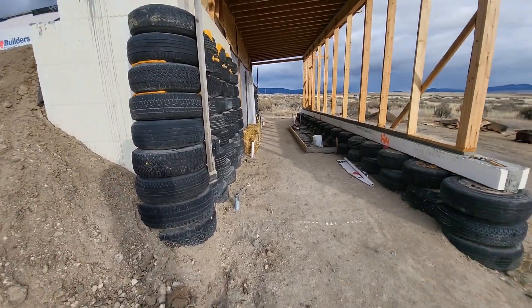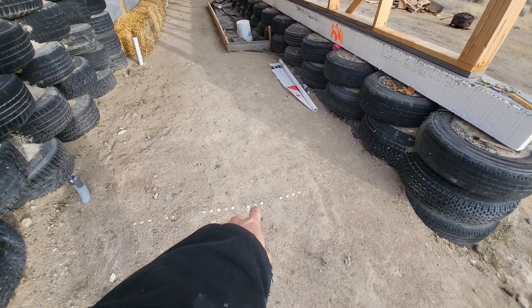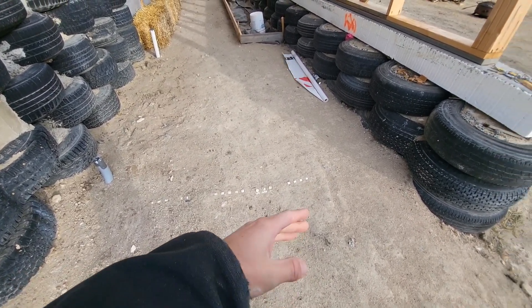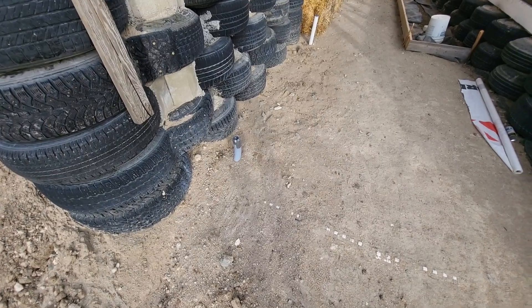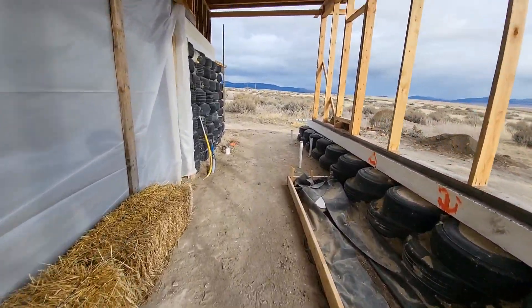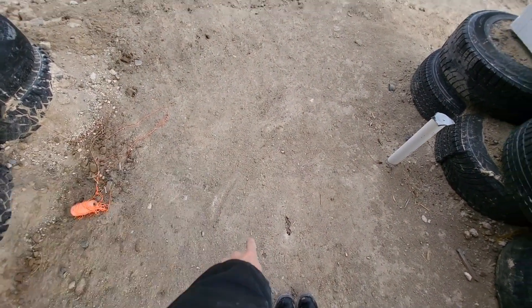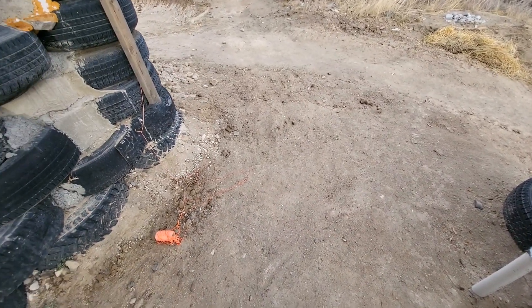As well as finishing the berm and the roof off, we also dug down right here. You can see the tops of some ICF forms — we didn't pour concrete in them, but we just kind of used them as a thermal break. There'll be concrete on top of that, and that'll keep the frost from going in and under into the building. You can see we also ran some conduit for electrical to come in. Did the same thing on the other side — the main sewer line's coming through, and that'll go out to the septic tank. We've got four feet deep thermal break right there.